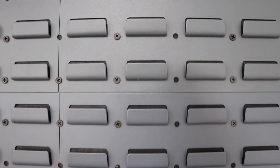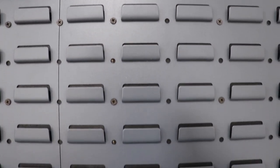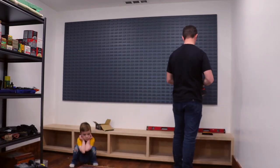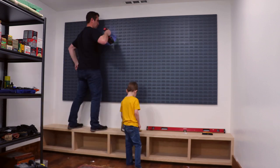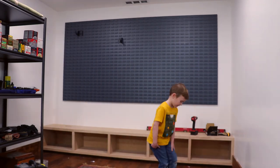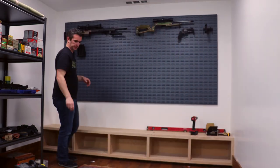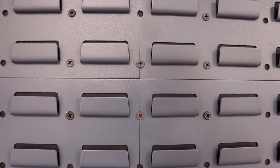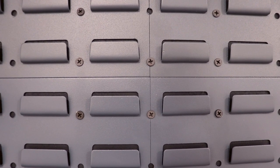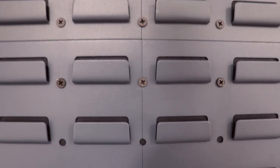The tolerances on this material are top notch. It's truly cookie-cutter panels — they line up exactly, there's no overhang, there's no discrepancy in the dimensions. Where the seams are, they also have half circles cut out, so when you butt the panels together you can screw a screw in between them, which will sync them right together.